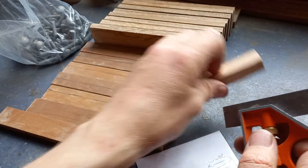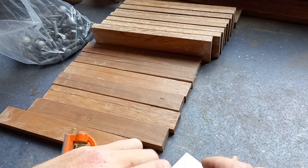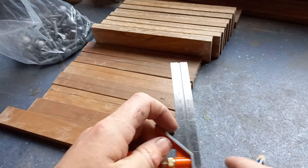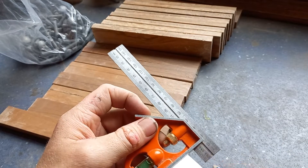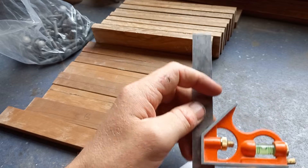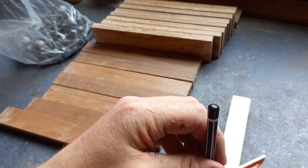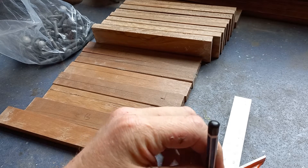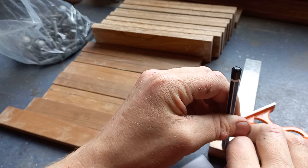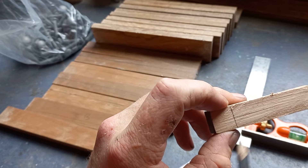So in order for that to sit properly somewhere, the same thing — we come along, we mark out 15 mil from there, then we use this edge of the square. We don't use this face here. We can even flip the square over so the greater surface area is across this surface. And what we do is make sure that the tip of the pencil — the drawing surface of the pencil — is on that line. And now, when we go to have a look at our mark, it is exactly where we want it to be.